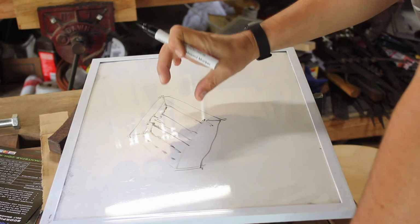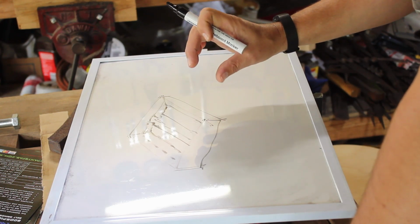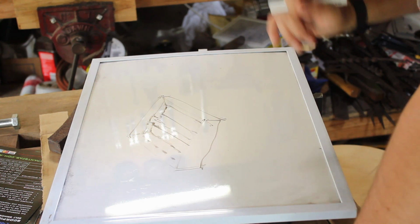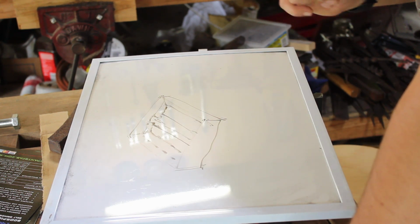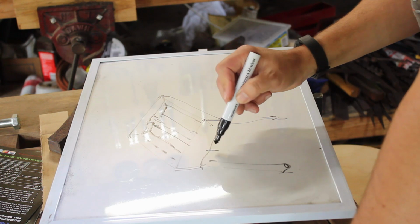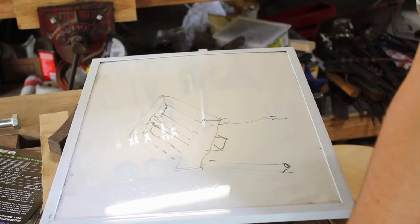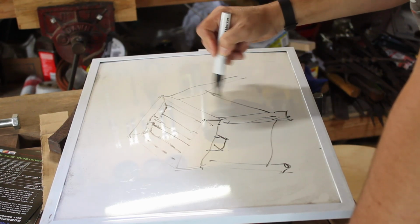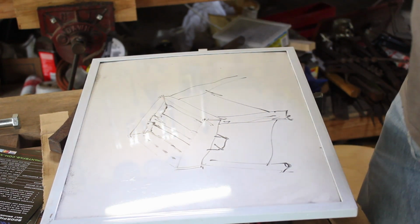Now I'm not sure whether a roughly 50mm worth of support at the bottom will be adequate to handle reasonably heavy hammering. I may end up having to space that down a little bit, but we'll see how we go. And then it'll have some legs. Here you'll see the angle iron disappearing off into there. Heavy gauge round pipe with some sort of bracing between them to keep the legs in alignment whilst you belt on it.